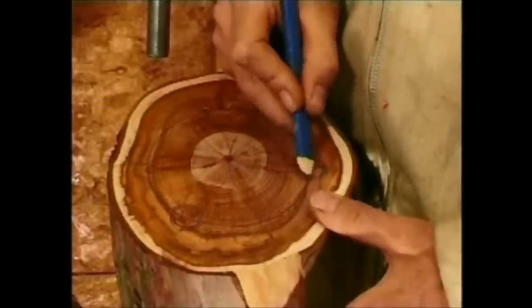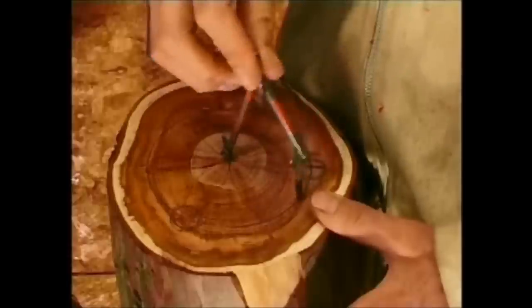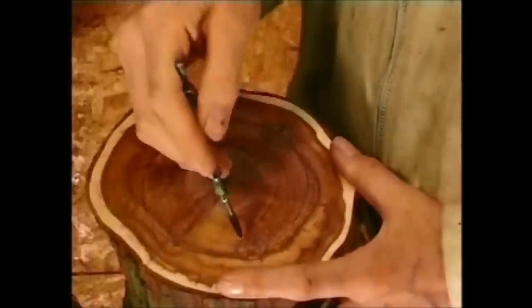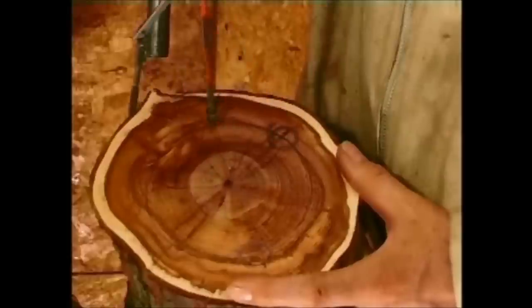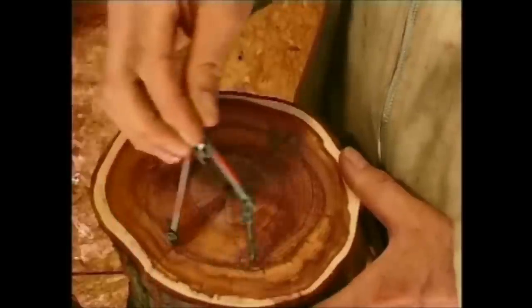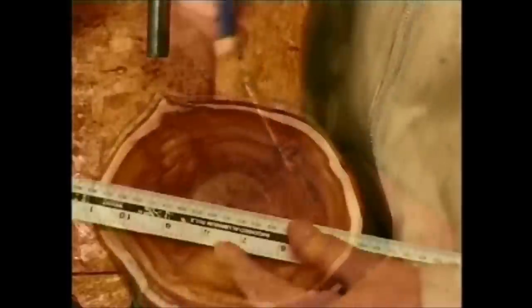Out of the lathe, mark up positions for the candle holes using a compass or divider. Draw a circle that passes some inch and a quarter from the edge. Draw the same circle on the base. Choose a point on the top for the first hole — the shape of the log may suggest an area. Mark the same radius from rim to rim. Place the compass point on the lines where they cross and repeat until the complete flower pattern is created.